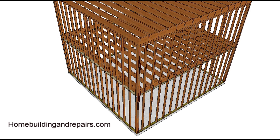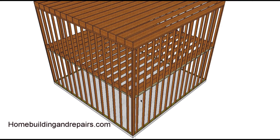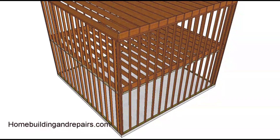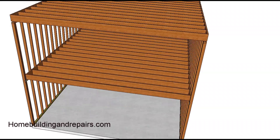You will need fire blocks — I didn't put the fire blocks in over here, but you will need them. This was another big problem a long time ago: these types of buildings wouldn't have any blocks in them, and of course a fire would start and could burn right through and just keep going. Fire blocks are used to stop the fire from burning through or grabbing fresh oxygen.